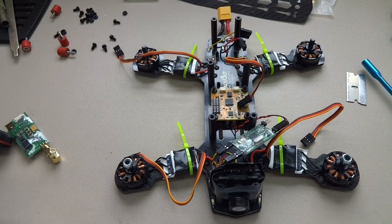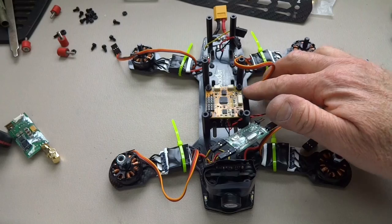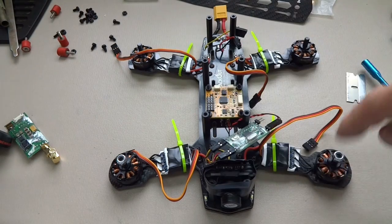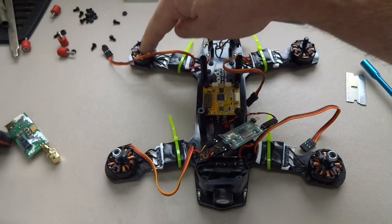All right, fellas, this next part is kind of important. I've made many mistakes on this. And you know you're wrong when you try to fly your quad the first time and it keeps flipping over and breaking propellers. And I've broken a lot of them by making this mistake. So try to remember the board that you're looking at. That's probably the key. So we're using a CC3D here. There's no industry standard for numbering our motors. So a CC3D happens to be 1, 2, 3, and 4.